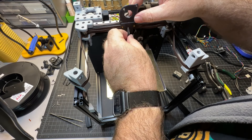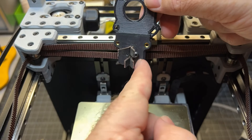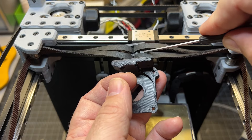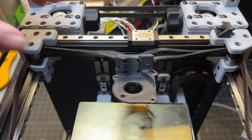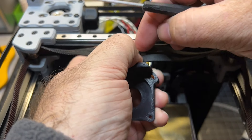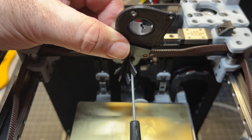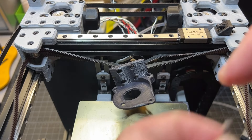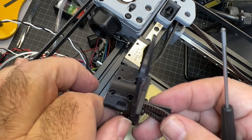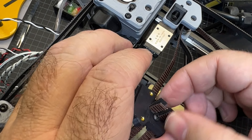Make sure your orientation is right. Don't pull these through too far because you're going to need to pull slack out, but you need them a little bit tight so you can get the maker beam nuts on. For the maker beam nuts, you're going to need M3x6 screws — don't use the M3x8s because those are too long. Hold the maker beam nut centered over the screw and then turn the screw with the nut on there. When I originally installed this I had about 5 teeth displaying, so I'm going to back these out just a little bit to get 5 teeth — equal lengths on top and bottom.